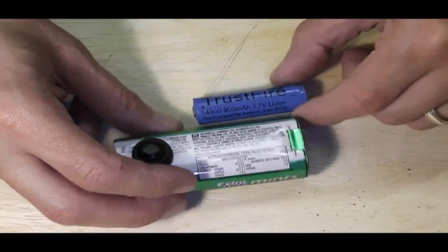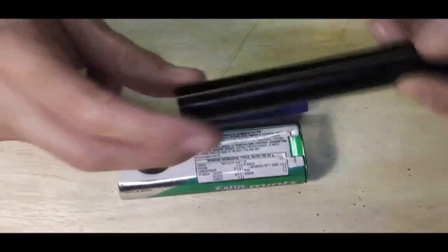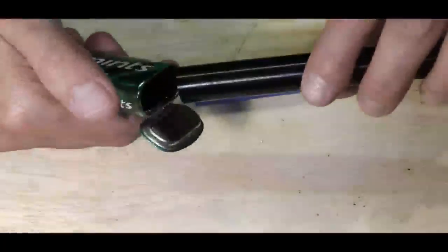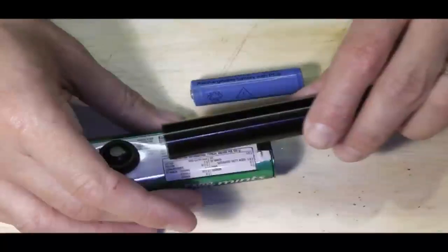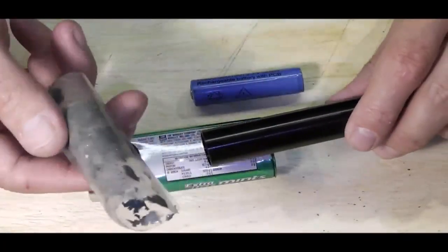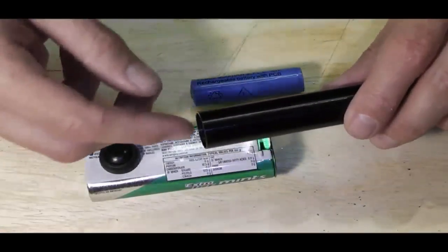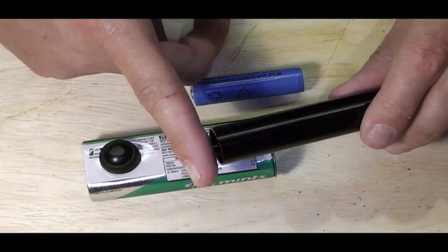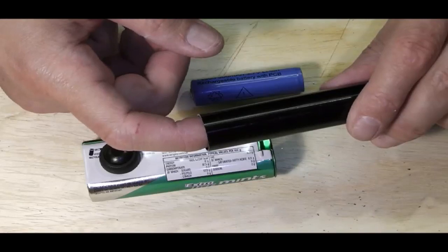So what I intend to do is use one of these tubes, knock that back widthwise in the lathe, because obviously that isn't going to fit in there. And then once I've got my tube, I intend to use our usual sort of putty that we've got, and actually make a base on this off putty with the centre pin in.